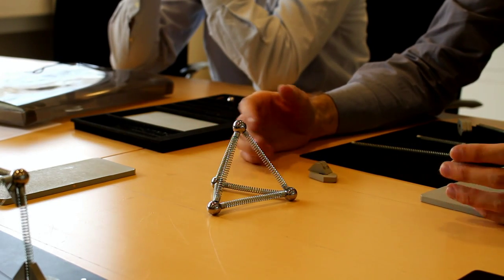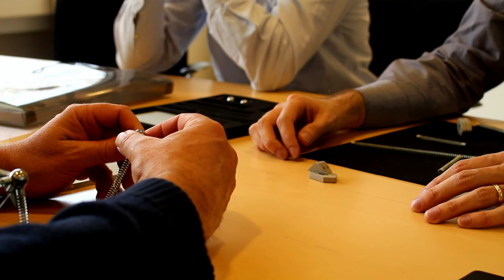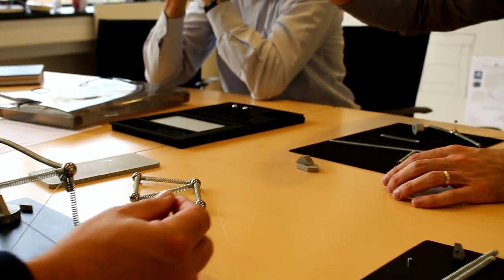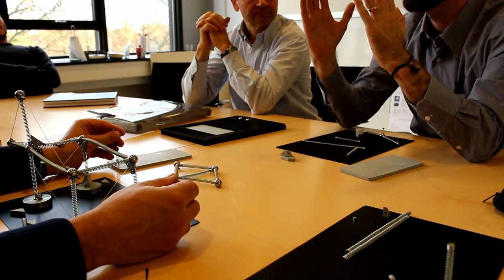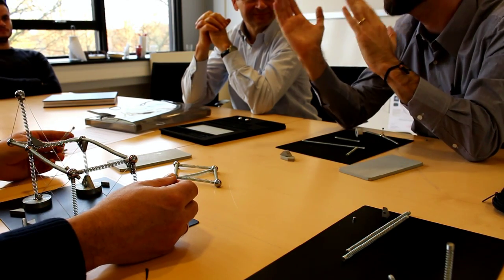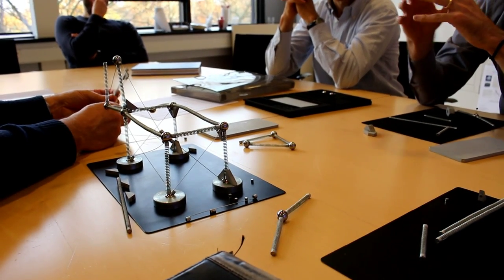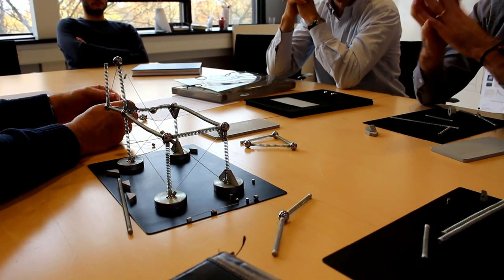So there are simple examples you can check. Also single degree of freedom systems, oscillators with different heights, different periods. Yes, it's very nice when you have a lot of pieces and you keep getting taller. You can see how, when you add one more floor, it moves sideways with wind loads. You can see how getting bigger makes more movement, and you can see the difference, for example, in this structure here: the movement this way is always bigger than this way. There are simple things that you can see here very clearly.